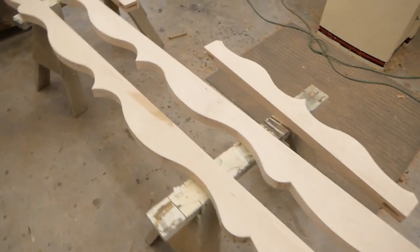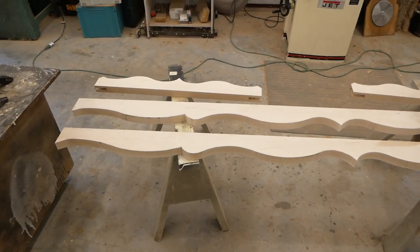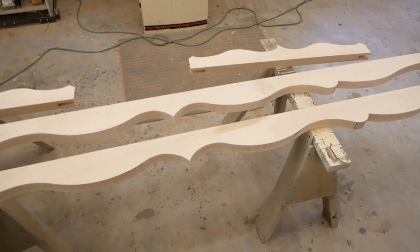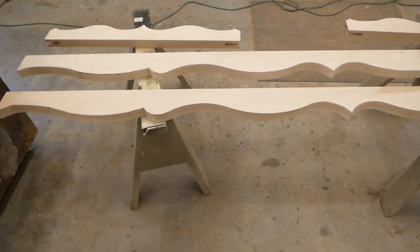These cut out great. It was a little tricky cutting the long ones — luckily my dad showed up and was able to help out. Looks really cool, everything works. The next step is to put the templates on and use the flush trim router bit.